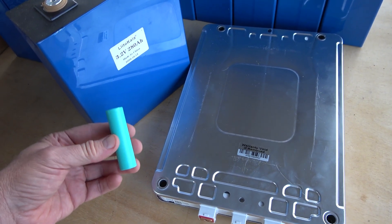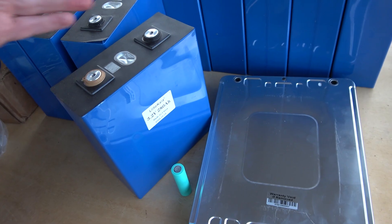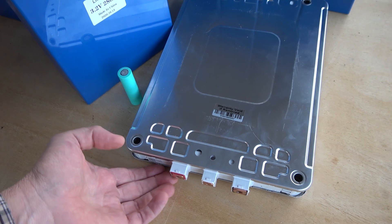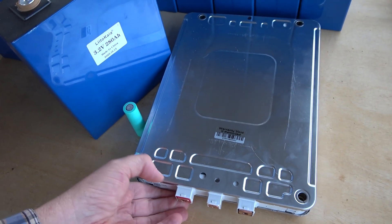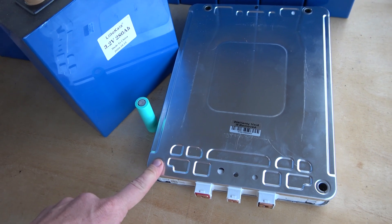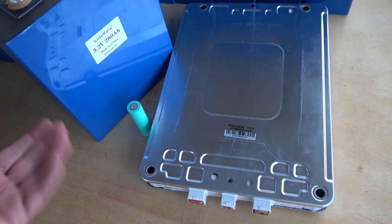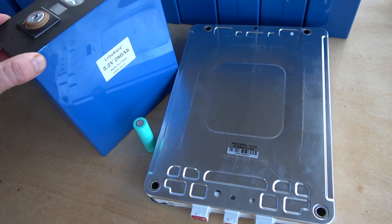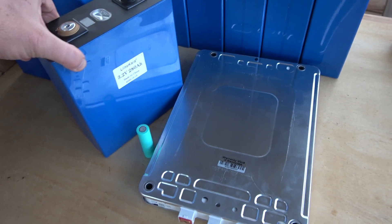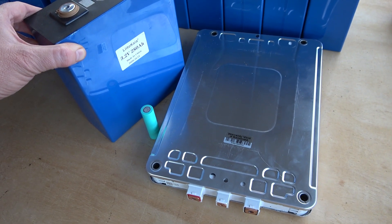That's why it's common to see cylindrical cells with 10C ratings — that's basically the difference between these cell types: how thick their electrodes are. This Nissan Leaf cell group, even though it's four cells, based on the power from the Nissan Leaf alone, should be able to output close to 200 amps out of what was — when fresh and new — only maybe a 60 amp hour cell group. So it's a very, very high C rate, and that governs the power density and what can really be achieved in terms of output power.